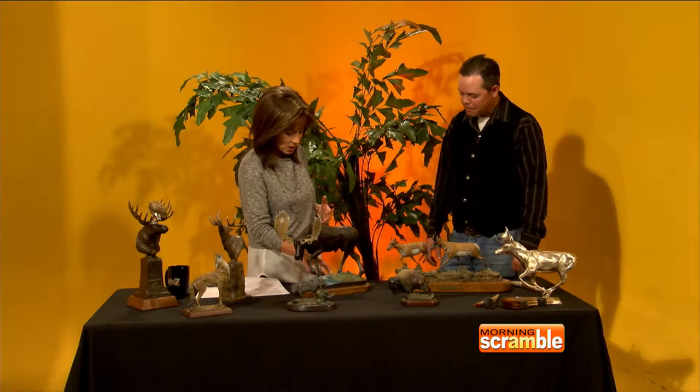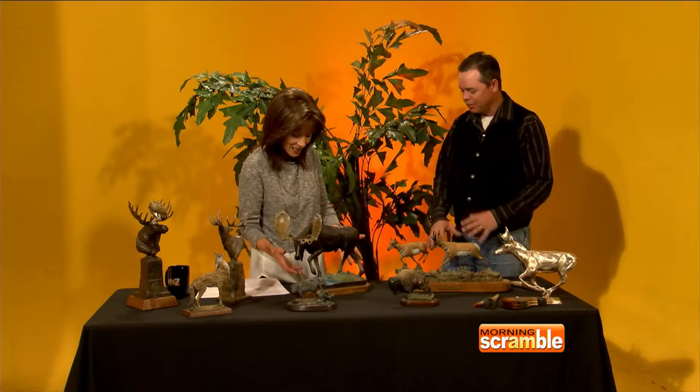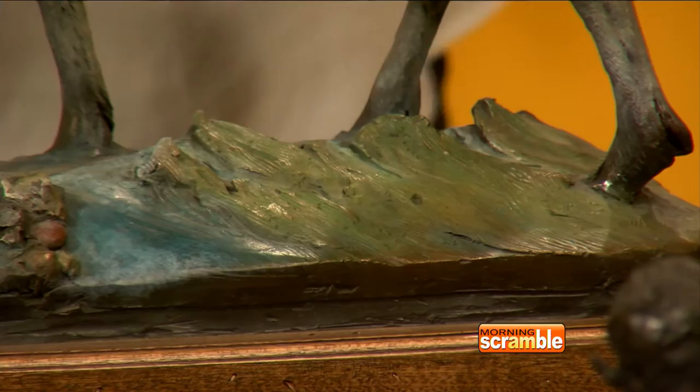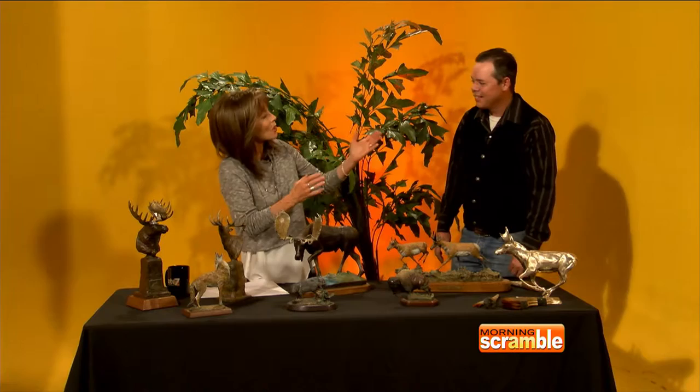Several steps in between. I do some acrylic and things, but it's just so neat to do it. So it's not all acrylic? No, no, it's chemical — on bronze. And then you touch it up. Is this patina? No, that's all patina, with the different mixtures and things that I do. Blue and green. So you're like a cook in a kitchen in the sense that you're putting things together to get different colors and effects. Absolutely. Do people request certain things — say they want it to look a certain way? Yes, I do a lot of experimenting. I might do a bronze and take it off and then do it again. We might do several steps to get really the look that we're looking for. So it's heated up, you're putting stuff on, and seeing how it's developing through the stages.